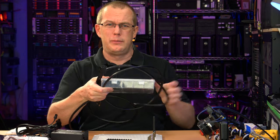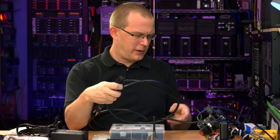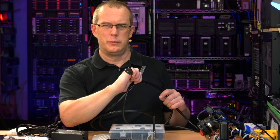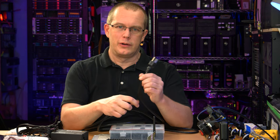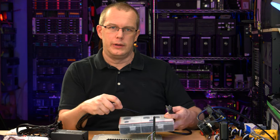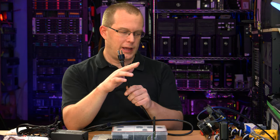And for the power, I'm just going to use a standard 10-footer power cable with a C14 connector on one end and a NEMA 5-15 on the other end. And actually, I'm going to have to chop one of these off in order to fit it through the cable gland that is going to ultimately go into the enclosure. So I'm going to end up cutting off the plug end